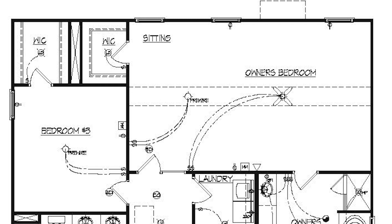These two lines on the plan indicate a vaulted ceiling. Why is that important on an electrical plan? A vaulted ceiling rises up in a triangle shape, and though this one is not a sharp triangle, the electrician needs to know because he'll need a longer drop rod for the fan. If he uses just the basic three or four inch drop rod the unit comes with, the fan blades will hit the roof — so it needs to drop down much lower. That's pretty much the basics on an electrical plan.